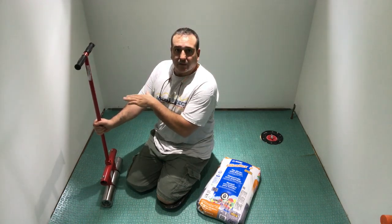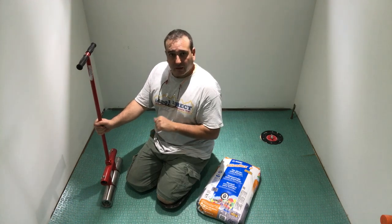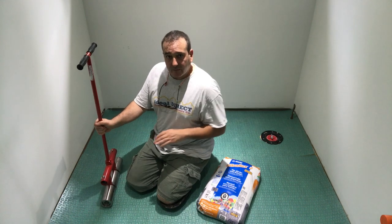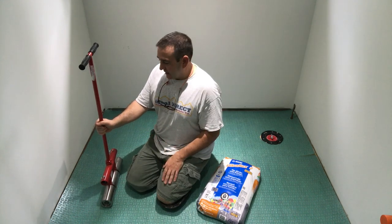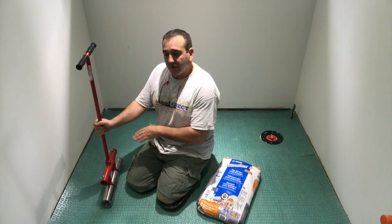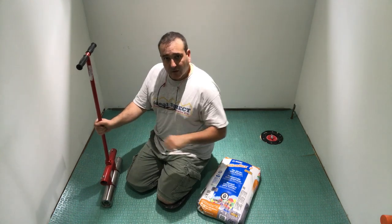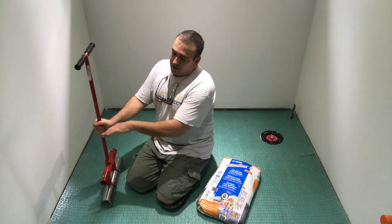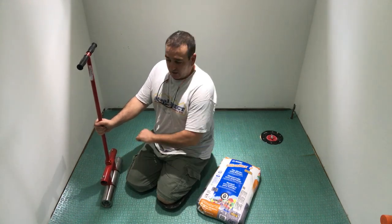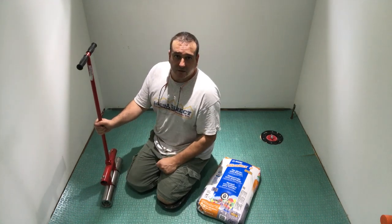And so basically what happens, once the sheet is installed, I'm gonna use the wooden float like I just said, and then I'm going to roll this a few times. We'll show you in the time lapse. And that's pretty much it. It's going to be flat. So once the one sheet is installed, then I'm going to start on the next, keying it in with the flat trowel, quarter inch trowel, and put the sheet on. Use my wooden float just to spread it, like push the membrane against the plywood. And then we're going to use this to roll.